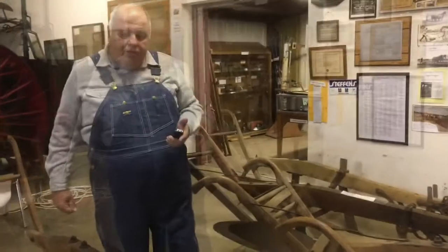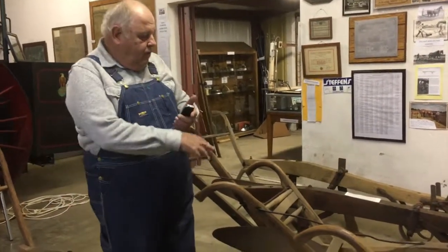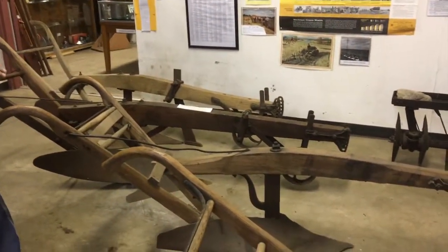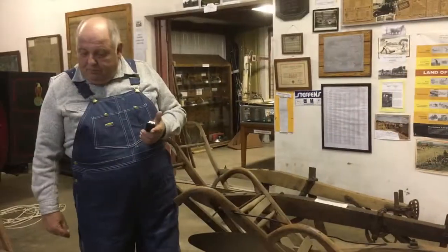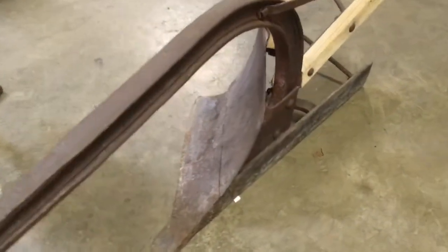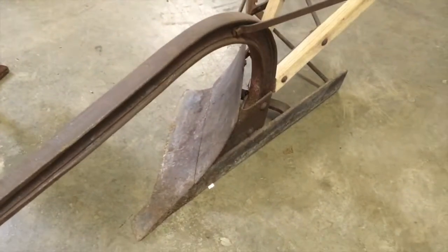A farmer could possibly have as many as 2 plows. The breaking plow was also used to plow up hay fields and grass that they'd planted. The land sides on the plow, the longer parts, have to be longer than the plow lay, otherwise the plow will shove out of the ground and you won't get any plowing done.